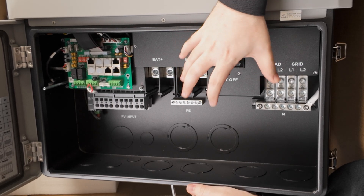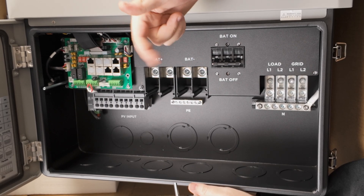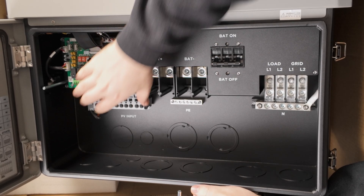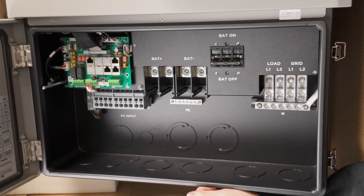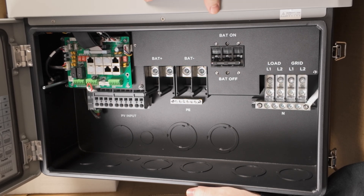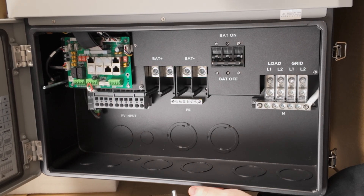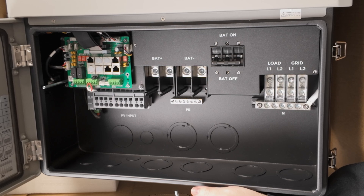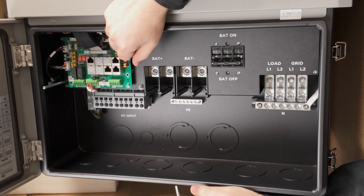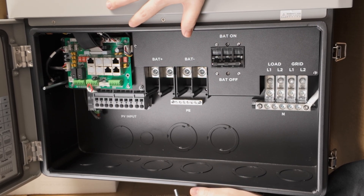In order to save the most money for the customer possible during the installation, we only put the components where they're needed to go, and that will allow you to save on the resource of all the breakers, wiring, and the money of all the installation overall. We do still have our RSD transmitter inside of our MPPTs here, so that when you have your array installed — up to 21kW of power that can be utilized — that will be able to RSD from the RSD of the GridBoss or the FlexBoss, whichever you activate from. We can see that MPPT 2 has an additional connection to enable our systems to get up to that 21kW from the 18k PV. These have two, two, and then one input with an amperage rating of 26, 26, and 15 amps, so you can get some high-amperage panels in here and make the most out of that solar DC bus.